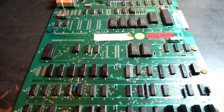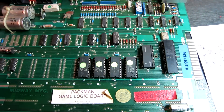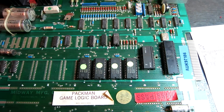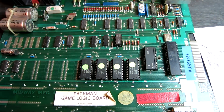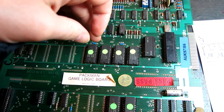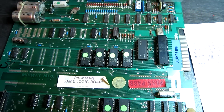Let's grab the logic probe and have a look at what the CPU is doing. The first thing I did was check the CPU had clock and was getting a reset signal. It was actually resetting every second, so it was watchdogging. The next thing I did was check activity on all address and data lines — that seemed to be fine. I checked the decoding going to the ROMs to make sure they were all being selected, and I also checked the data and address lines on all the ROMs. That was all fine.